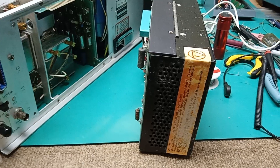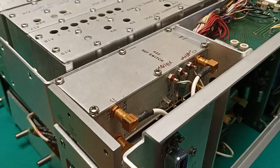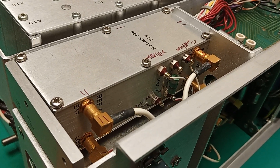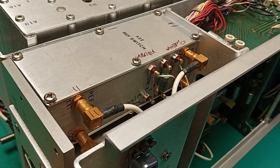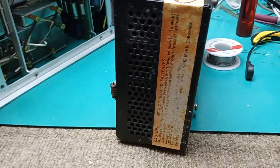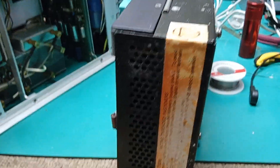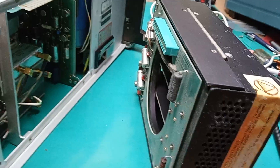To get the A22 assembly out and access the board underneath, there's a reference switch on top. You'll see a cover on top and a cover on bottom. There's a PWB upside down under there. The regulator assembly comes off — take a couple screws out underneath, take out four long screws with machine spacer standoffs, and that thing just unplugs.